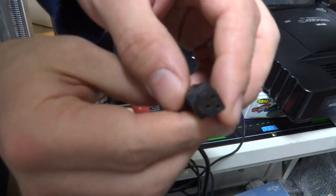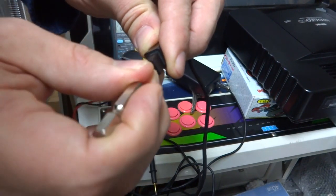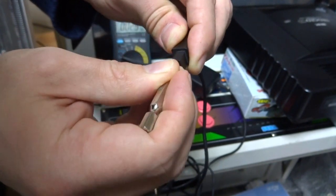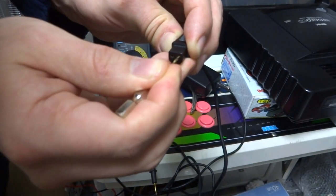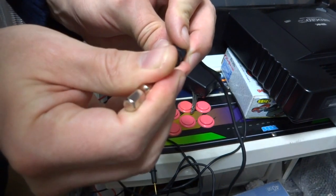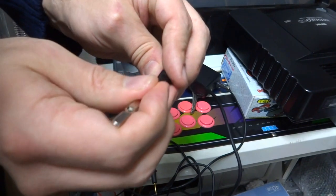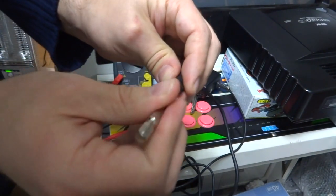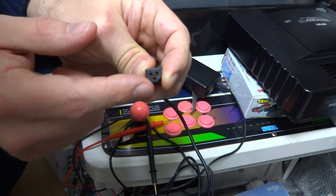What we're going to do is try to scrape away the inside copper here, because what happens is it will oxidize over time. By using something like this, you can kind of — like cleaning your ear — just try and scrape away any residue on the inside. You don't have to get it 100% clean, you just want to scrape away a little bit to make a better contact. In some cases, if you look at the ends of these they might actually be green — I've had a couple that were extremely green. Small flathead eyeglass repair screwdrivers work really nicely for these.